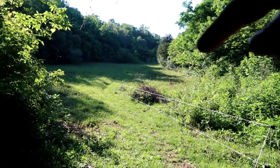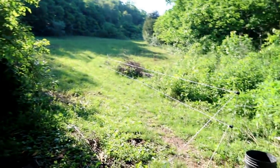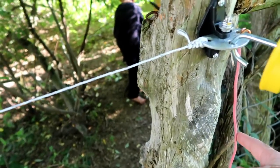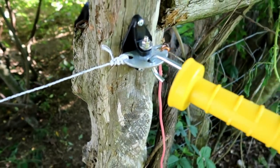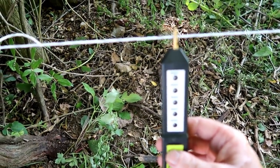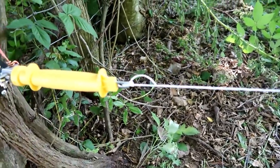When I disconnect this, the whole top line is not hot anymore, but the bottom line will still be hot. That's because of me tying them together. I can touch that because it's got coating on it. See it blinking — it's still hot. Even when the gate is open you still have some security: the bottom line is still on. If you take the bottom one off all the way around, the bottom won't be hot but the top still will be.